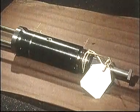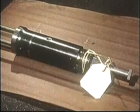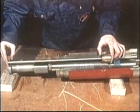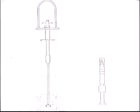Before fitting a new barrel and plunger, the tool must be so adjusted that the plunger is guided into position and locked correctly in the roller guide during assembly. The adjustment is carried out with a measuring rod of exactly the same length as the plunger, and this rod is screwed on to the spindle of the lifting tool.